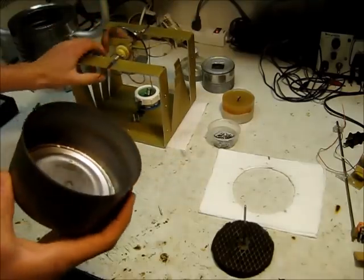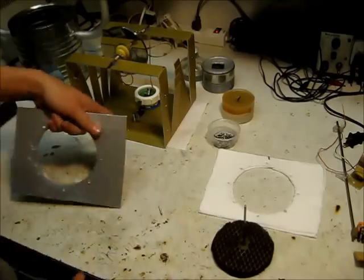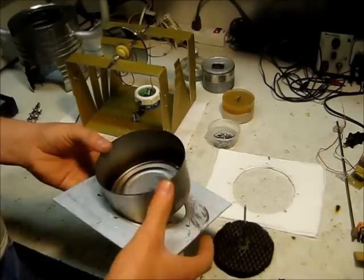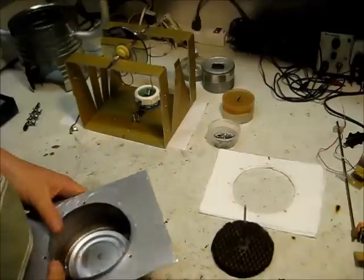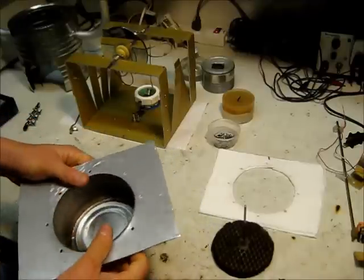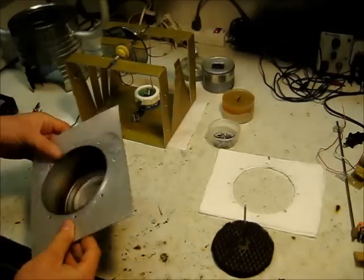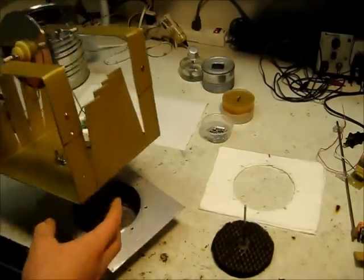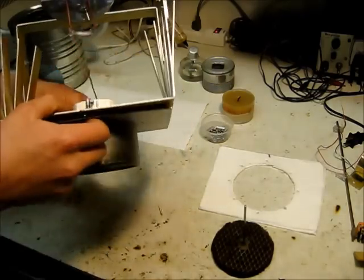The rim goes into this sheet of aluminum with eight holes in it, which match up to these holes. It's a pretty tight fit — I cut it with the reciprocating saw and then ground it so that the hole in this aluminum was perfectly matched to the tuna can. This will bolt with these little nuts here onto this, so there's a really good seal.